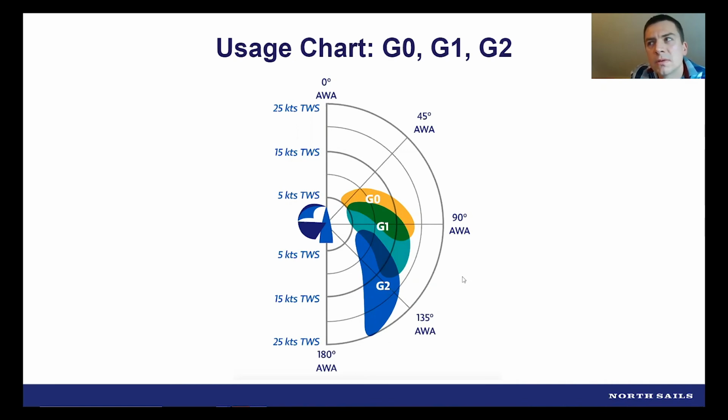And on that note too, there are so many different topics that could lead into a question about helix. We design sails around this helix idea, this idea of load sharing. So with that, you can come to your salesman, and you can come to North Sails, and we could say, here's our estimate of what your tack loading would be for different sails, and that would help select furling gear. But with the helix side of things, with our sails now, we are starting to engineer those cables specifically for the application of our plot here, as well as the material of the sail.